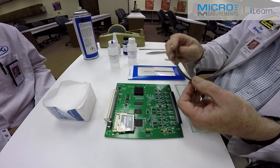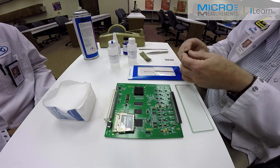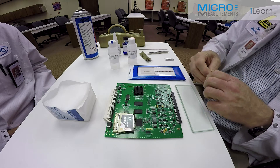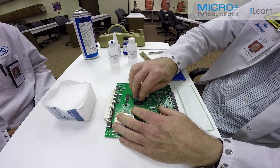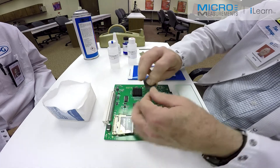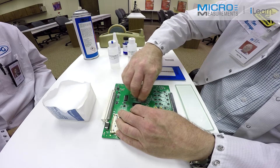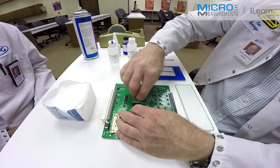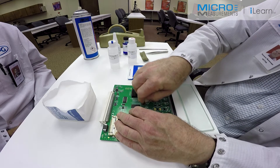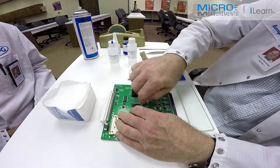The next step, I'm going to locate the 400 grit SCP-3, silicon carbide abrasive paper, and I'm going to dry-abrade the surface. We're just trying to take the shine off the part and make the surface the appropriate roughness for bonding and also remove any gross contamination. Since I'm putting it on the corner, I'm having to kind of slide up to the edge here with the paper.